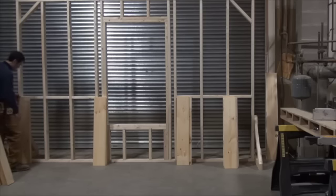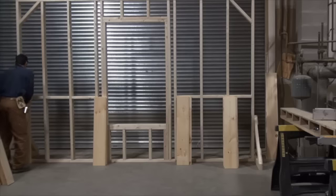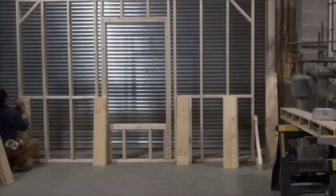We're starting the first piece on the end of the wall. If you had a wall going this way, this joint would get covered up, so you don't need to rip the first piece when you're beginning a wall that doesn't have pine on the other side. For the first piece you can face nail it, because when you do your chair rail you can cover up all these nails.